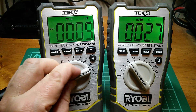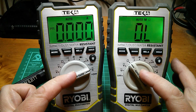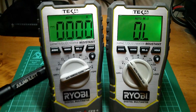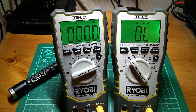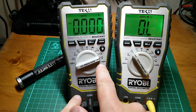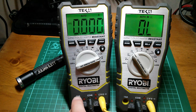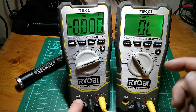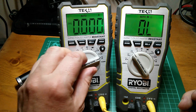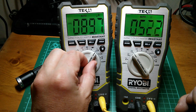Let's measure the resistance of the amps range. This is saying overload in megaohms - so this is saying open circuit. That's probably because on the amps range we have to use the 10-amp connection, where there's a thick piece of wire between there and common. So when measuring the resistance of the amps range it's infinity ohms, but the resistance of milliamps and microamps is much lower.